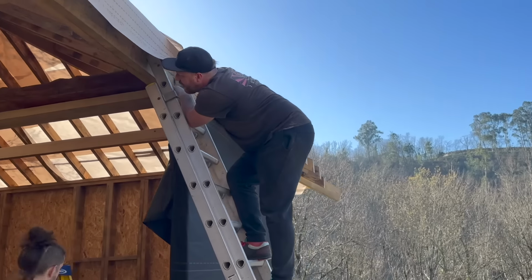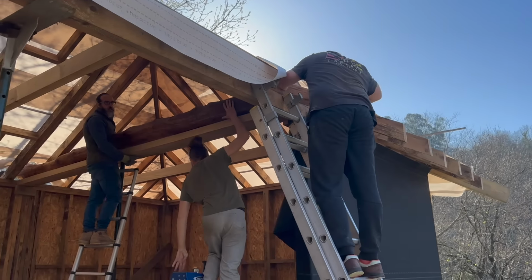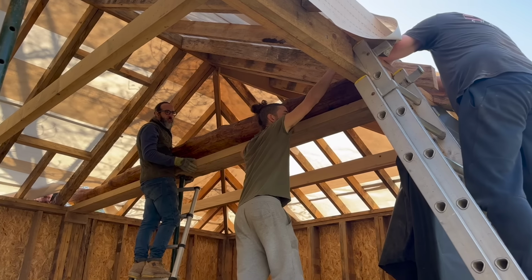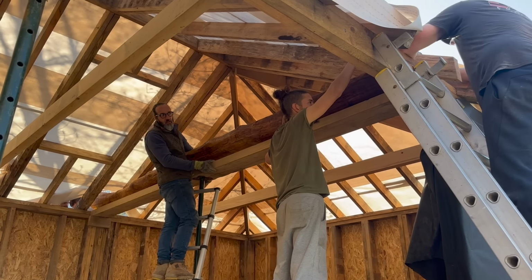So Badger just cut another hole in the waterproof bit there. Okay, so it wants to be for the post to come through. So it needs to be beam, about 30 mil of a gap between this lip and the wall plate. Do you know what I mean?